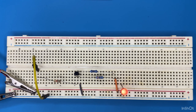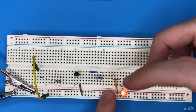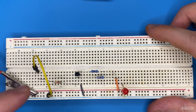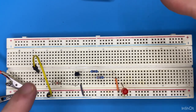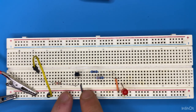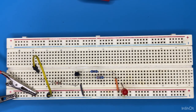When the transistor is off, it acts as an open switch between its collector and emitter. An open switch means there is high resistance between collector and emitter, therefore current prefers to flow through the resistor to the collector pin and finally to the LED, making the LED turn on. But in the opposite case, when we have a high on the input, there is enough current flowing through the base resistor into the base of the transistor, turning it on. In this case the transistor acts as a closed switch, current travels to the collector and then to the emitter — since the emitter is connected to ground, the LED remains off.